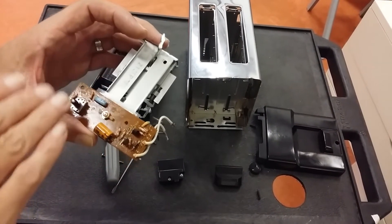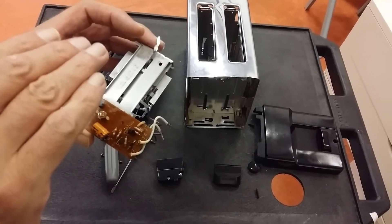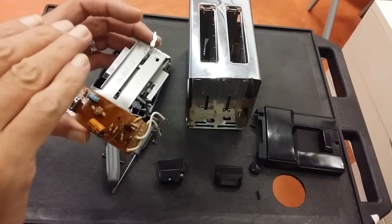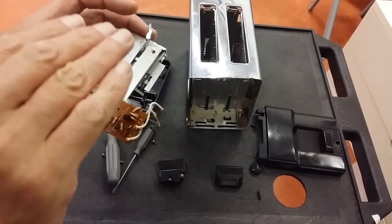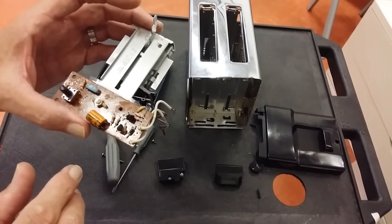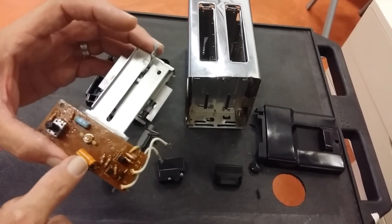The capacitor will just keep the high peaks of the voltage and store those charges. So it keeps the voltage nice and high, instead of going bump, bump, bump — which is what we get if the capacitor was not there. So we have ourselves a reasonable supply.